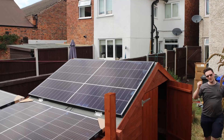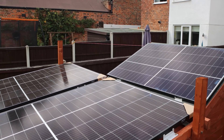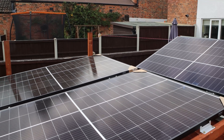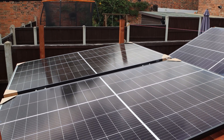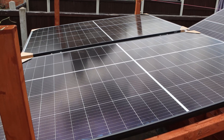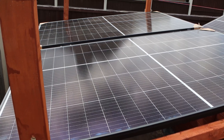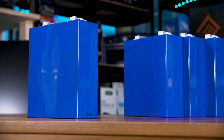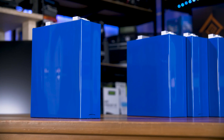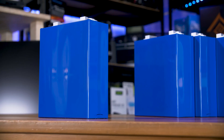Let's dive in starting with my setup. In 2022, I bought three Trina Solar 400-watt panels, a Renogy 60-amp MPPT charge controller, eight Fogstar LiFePO4 cells, a 250-amp DALY BMS, and a 3-kilowatt pure sine wave inverter. All of that was something like two and a half to three grand, with the majority of that being the battery itself.